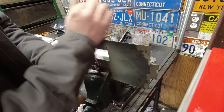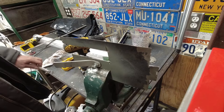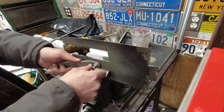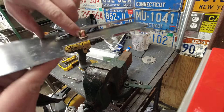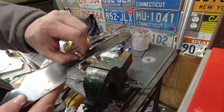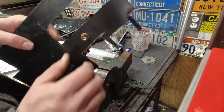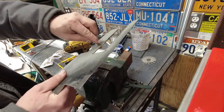Crank that down so it goes nice and hard, take that wrench off, loosen the nut half a tick, unscrew this — and see, it's now there. If you pop this out you can see on the back that it's mushroomed out, and because it's ridged like that it's now gripping. This is not as solid as welding a nut in place but it's pretty darn good. These shouldn't be used for very high torque applications, but for what I'm doing it's perfectly fine — now this is just a threaded hole as far as using it is concerned. That's a rivnut, and that's what we're going to be using.